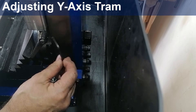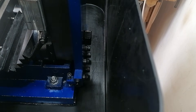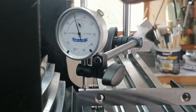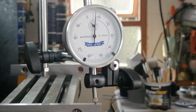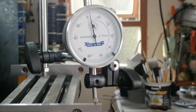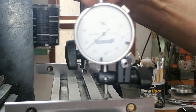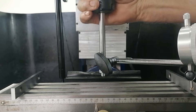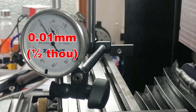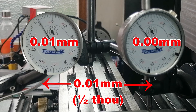Now to fix the front-to-back alignment. The fine adjustment screws are not needed here, so I backed them off. With everything loose, the column now hangs forward by about 0.08 mm. To bring it back, I tightened the three rear bolts a little at a time, checking the dial after every change. After a few more small adjustments, both front and back reach almost exactly the same. To confirm, I swung the indicator to the right side of the bed — it shows 0.01 mm at the front and 0 at the back. That is as good as I am going to get on this machine; the mill will deflect more than that even during light cuts.